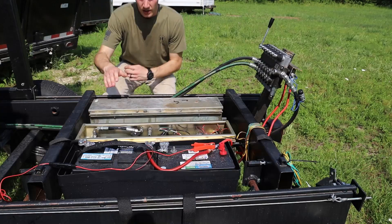An electric motor running a hydraulic pump is close to 100% efficient — it's high torque and only needs to run for a very short period. A gasoline engine running a hydraulic pump is closer to 50% efficient. Gas-powered hydraulic pumps start at around 11-16 GPM with a recommended horsepower, but you're probably only getting about 50% of the rated flow under load. So that 11 GPM pump really only delivers about 5.5 GPM. Electric will provide rated flow consistently.